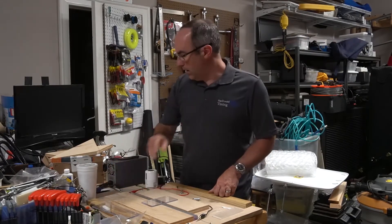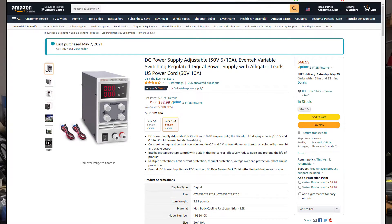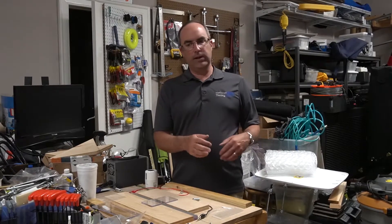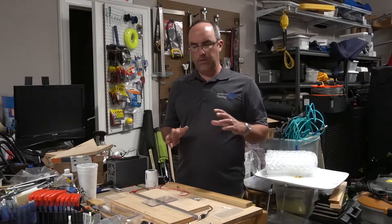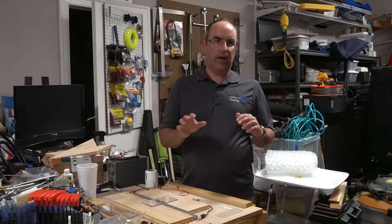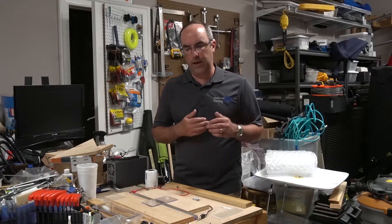The power unit I got is an Eventech power supply, which goes up to 30 volts. I've seen people be successful in the 10 volt and 10 amp range, but every nichrome wire setup is different. Mine ended up being higher on the volts and lower on the amps.